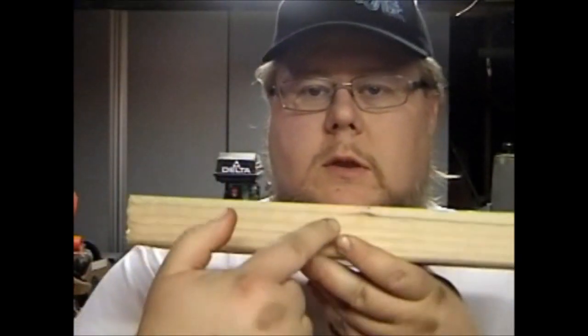Now me being who I am, I'm going to take it a step further, and I'm probably going to slice a layer off of the top of the 2x4 and do some scroll work in the top of it to give it a little fancier design, of course. Either that, or I'm going to layer in some of the old cedar fence board too, because a chest that deep, and having a bottom and a top out of the same wood, it's not going to be a very deep chest. Plus, it's only a 2x4, so it's not going to be very much bigger than a simple jewelry box. So I think what I'll do is layer some old fence board top and bottom to give it color contrast and some more thickness to the box.